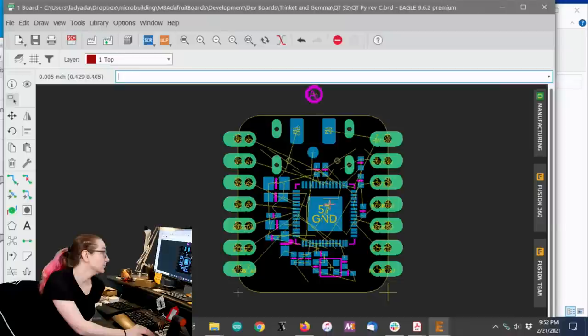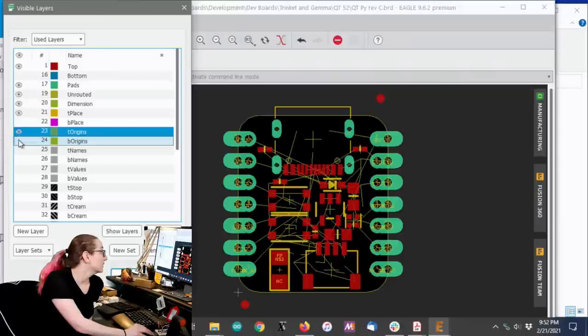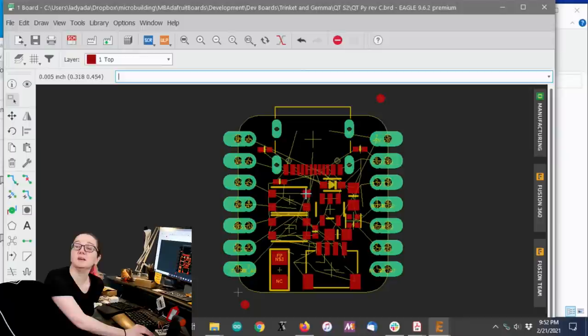So they've got the crystal, a bunch of capacitors, and then I have this idea. I'm not sure if it's a good idea, but sometimes I don't have good ideas, and that's okay. Hold on. So this is what the top looks like. The top has the USB-C, two buttons, because you need one for boot zero and one for reset, power supply, little NeoPixel, STEMMA QT connector, of course, and then this is the antenna.